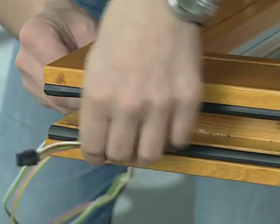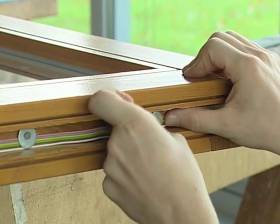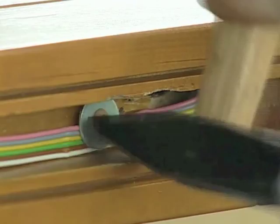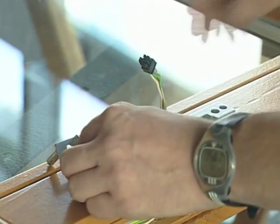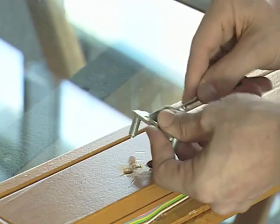For retrofitting the Y guide rail HH0130, the cable must be fixed in the upper sash groove with large diameter washers and nails. The nails must not damage the cores of the cable. If necessary, attach the actuator base with the packer provided.